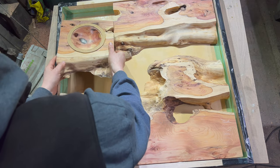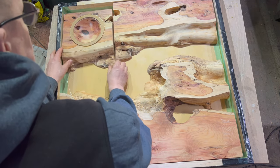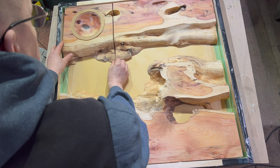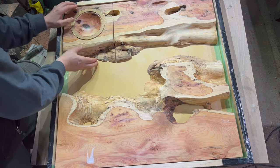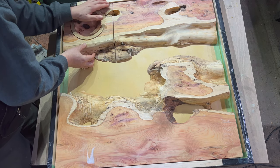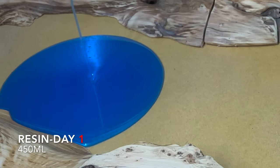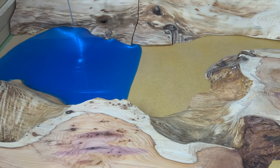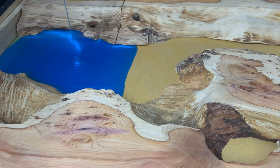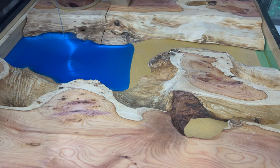A bowl can go in there, allowing for the previous cut mark, because I've got to be cutting down that cut mark again and tidying up the line as possible. And then quite a nice big river bed. I think first pour, I'm going to pour quite a deep pour — not massively deep. I'm going to do four pots at 450ml each — that's 1800 millilitres, almost two litres.